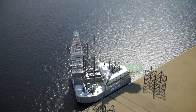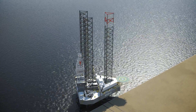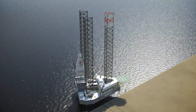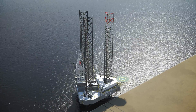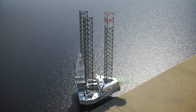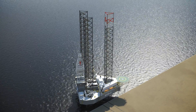Once into position, the rig is jacked up, and the remaining leg sections are lifted onto the rig and installed. Finally, once the rig has its full complement of 555 feet, or 169.1 meters of leg, lifeboats are installed, and the R550D is ready for jacking trials.